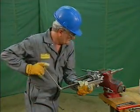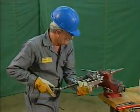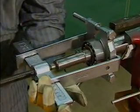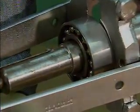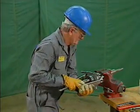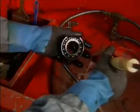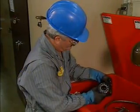In this part, we'll watch a mechanic prepare to install a new rolling contact bearing. The mechanic begins by carefully removing and cleaning the damaged bearing. After a bearing has been removed from a shaft, it should be handled carefully — it should not be left where it will get dirtier, and it should not be rotated, banged around, or dropped. Handling the bearing carelessly will only make the task of determining why it failed more difficult. To properly inspect the bearing, the mechanic must first clean it using an approved solvent to remove grease and dirt.